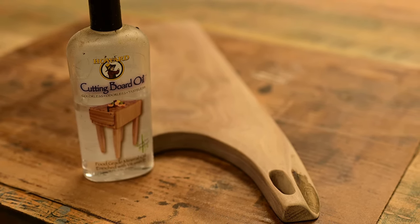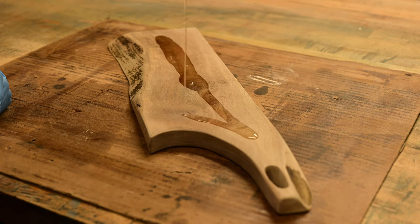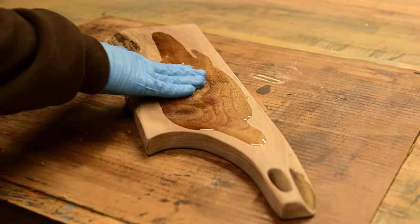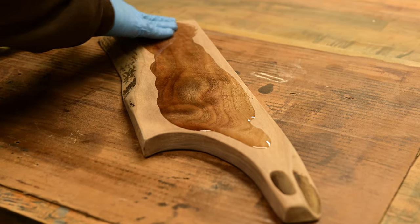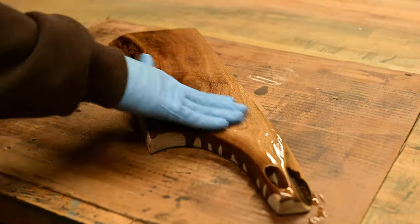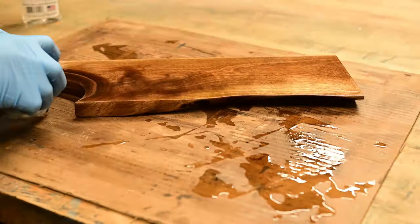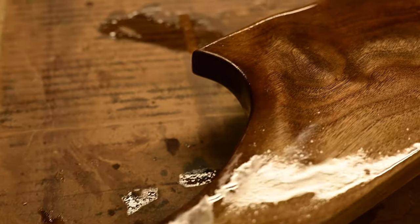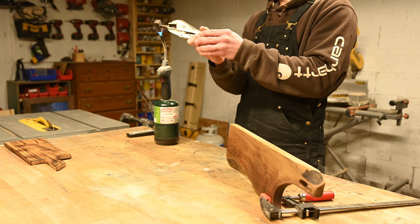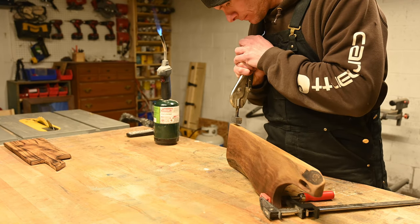This is definitely the best part of making cutting boards — putting the mineral oil on, which I'll link in the description. You can basically watch the board come to life and watch all the grain pop, especially with black walnut — the wood is beautiful. I put it on pretty heavy, then set it on my bench pucks and let it soak in for a couple hours before wiping off the excess, then let it sit for 24 hours. There was also a step I forgot to do before oiling the board, but I went ahead and did it anyway over the oil and it turned out pretty good still.